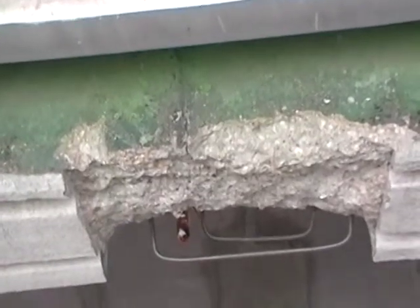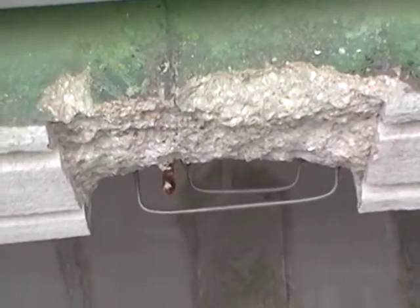There are various cracks in the floor which are evenly spaced approximately 30 inches apart. And we have an additional shorter crack which only extends about 2 foot at an angle into the slab. This crack extends nearly to the curb and takes up again on the curb. That crack then extends on top of the curb and down into where the previous concrete patch has been taken out and removed. This is a fourth crack in the slab between the two windows, and another crack that is centered on the door.